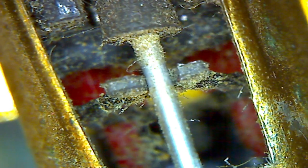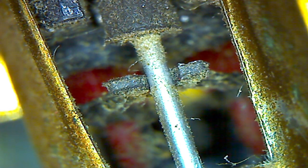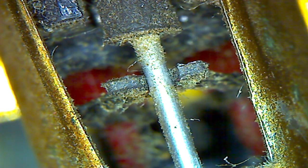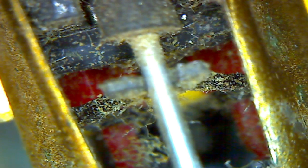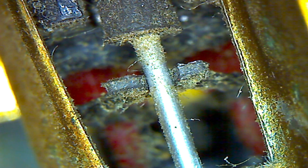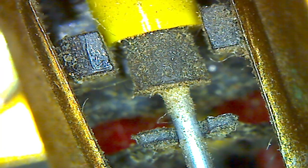And you can see from the leverage situation, we're not talking about much movement at all here. The needle on the far end is moving with the groove, but by here, because of the lever arrangement, not a lot of movement. A little bit transmitted down through that gripping thing, and down to a magnet, the one magnet. This is a mono player, and then the magnet moves relative to the coil, which is hidden in there, and produces a little bit of electricity. Just like Michael Faraday did many, many years ago. Was it Faraday who did this?